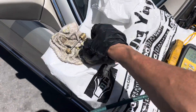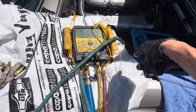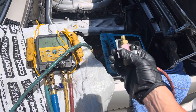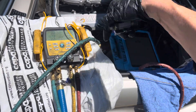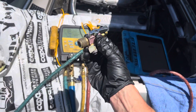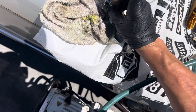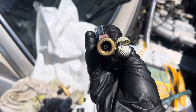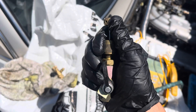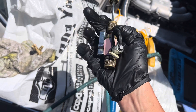This tool right here is a core removal tool. You can remove the valve core while you have refrigerant gas inside the system and not lose any gas. Say you finished your air conditioning job, removed your fitting, and found the valve core is leaking refrigerant — but you just recharged. You don't want to do it all over again. You get one of these, slip it on, put this little part on there, screw it down, and it will come through just like you see right there.